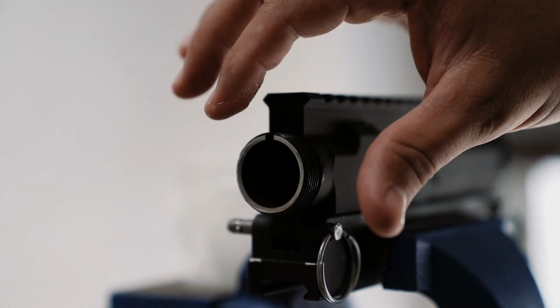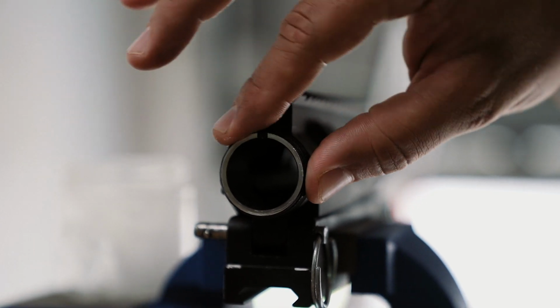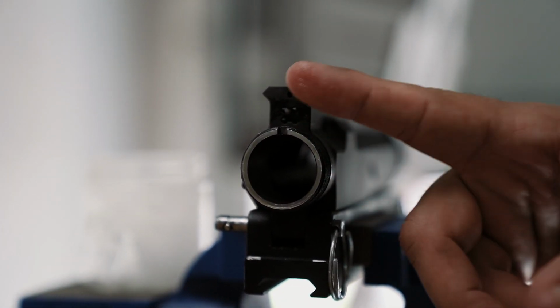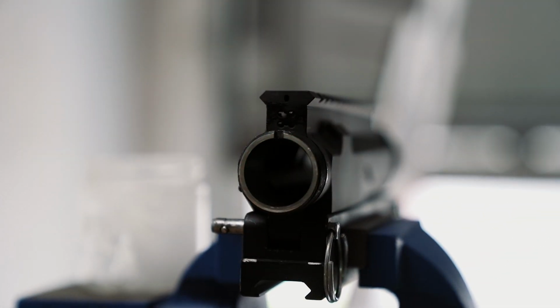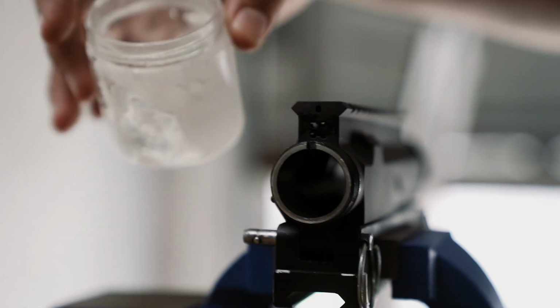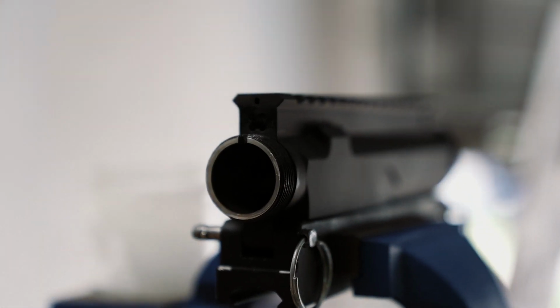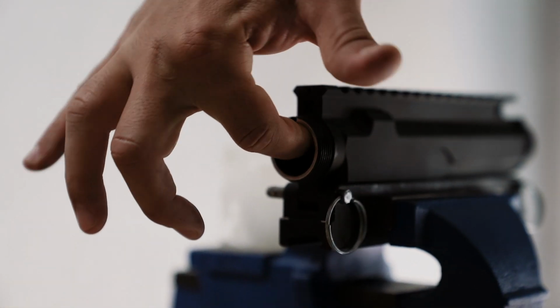Dry anodized aluminum will prevent other aluminum pieces from being run down all the way. They will also give you a false torque if you don't have some sort of anti-seize compound like I've applied on these threads right now. A little bit of forethought goes a long way, and that's another reason why we use certain greases and anti-seize lubricants like these. A little bit on the inside works as well.